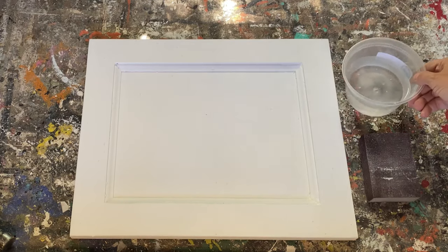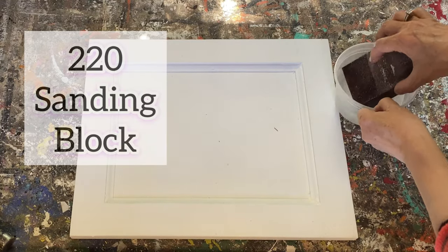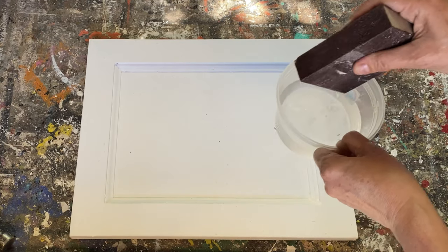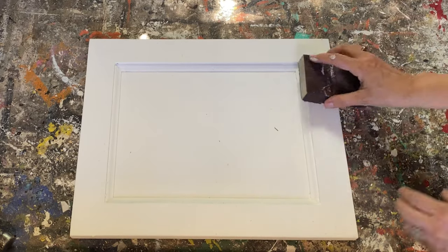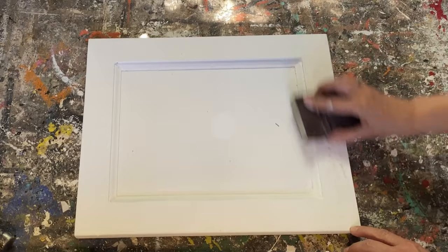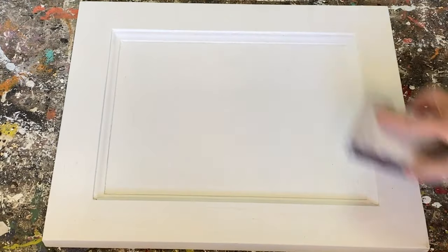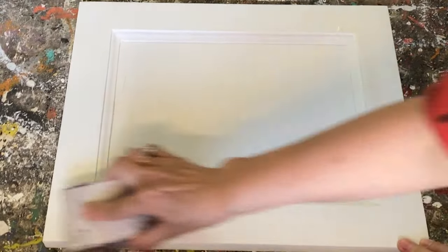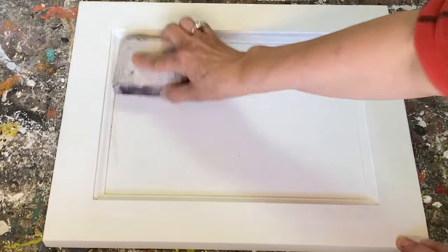What you're going to need is a dish of water and a very fine sanding block — this is 220 grit. You want to polish the top of that chalk painted surface without removing any paint; it'll remove all of the rough surface and give it more shine. Dip the sanding block right into the water until it's moist, then sand down your whole project going back and forth in all kinds of directions. As you're scrubbing you'll start to see the brush marks fade and any granular bits get sanded away.